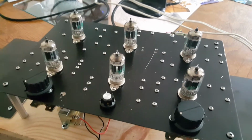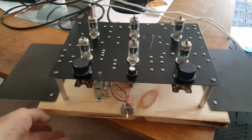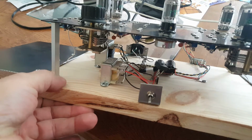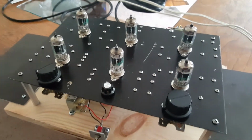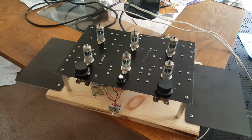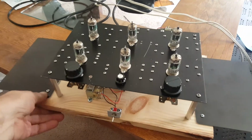Check this out, guys. 6 vacuum tubes, 6 valves of type 12AU7. You want to see something, man? Check this out. The power supply lives on the base, on the bottom. By my thumb, 2 transformers, one for B+, which in this case is 50 volts, the other for filament supply for the tubes, or the valves. This Theremin design uses 10 volts AC on the filaments, not 12. Art wonders why. I wonder why. All I can think of is maybe for tube longevity. But it'll also draw less current on 10 volts, so you need less of a capable transformer probably as well.